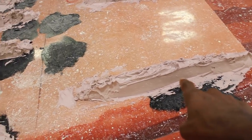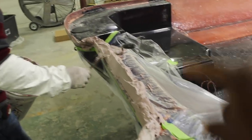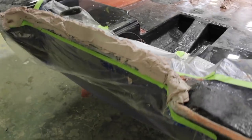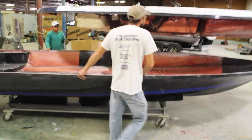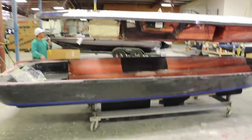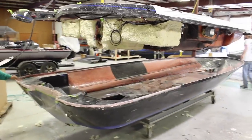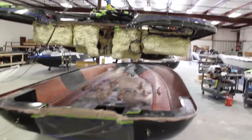Not only is it bonded from the bottom, it's going to be bonded from the sides. Put screws and adhesive along the sides. They're also doing it. Opie, you told me they put glass back here too, right? So he's bonding it all along the transom, which is super important back here. This is where all the vibration and power is transferred on the transom. So now they had the whole deal dry fitted and put the mud in the bottom of the hull. They know everything is going to fit together just perfectly. Go back and make this Falcon sandwich again.